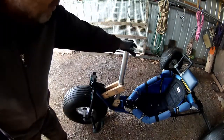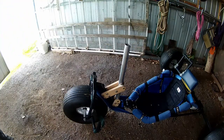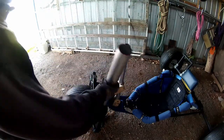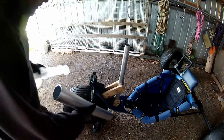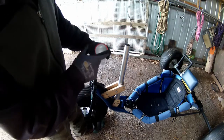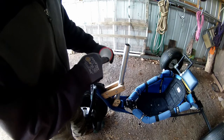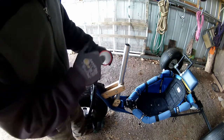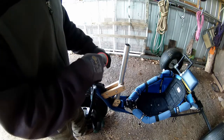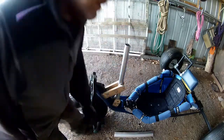This is supposed to be 54-55 millimetre inside diameter, and somewhere around 250 to 300 millimetres high. Voila, one proper mast step. At the top of this it should be flared out a little bit, but I don't have the knowledge or the tools to flare it. So I'm going to file and smooth that off as much as I can, so there's no stress on the mast where it exits that. So I'm going to use that as my mast holder.